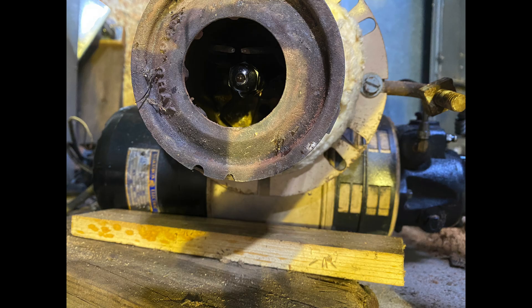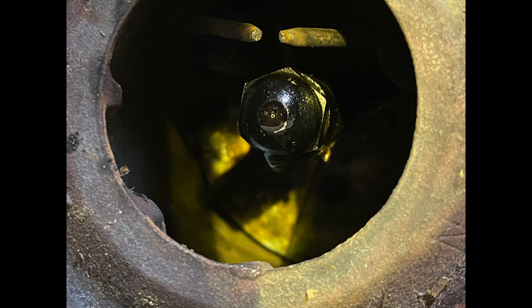Here you're looking at the head of the conventional burner. That's a piece of cast iron with some swirly things cast into it — that's supposed to make the air swirl around, but it really was not very effective, and in fact a lot of them kind of burned up and fell apart after a while. You can see the size of that hole. The electrodes are right above the nozzle, and as you can see, a pretty large volume of air is going to be moving through there.